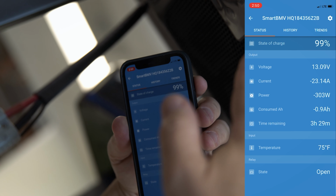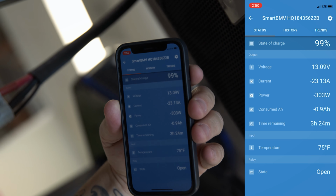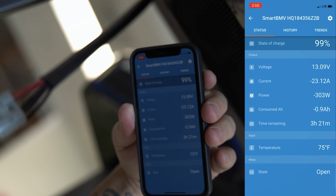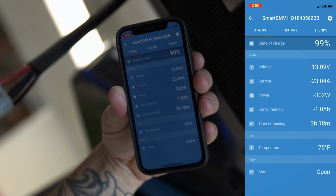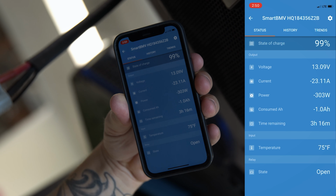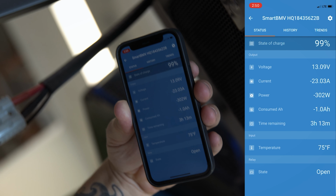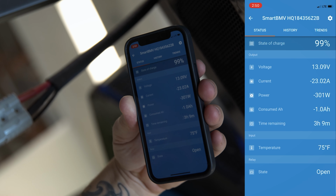And we're basically going to wait until this thing's done. I don't think it's a full test or a great test because we weren't at the 14.2 volts at the top end of what this battery can hold. That's just poor planning on Kenny's part. He should have charged the battery before we did the test. But what are you going to do? We use these batteries every day around here to test a whole slew of things.